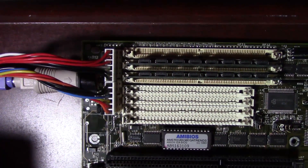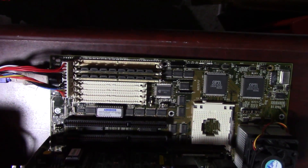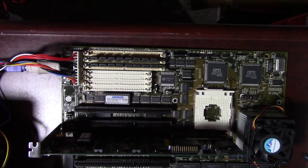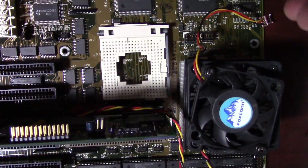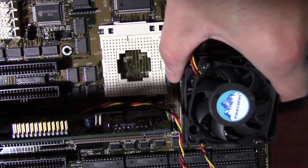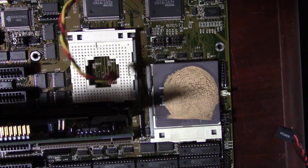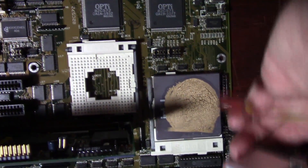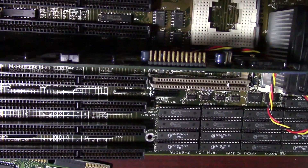Hello there everyone, this is WaybackTech, and in this video I'm going to be taking a look at that mystery board that I fixed in the last video. Gamer1990 used its Columbo-like research skills to figure out exactly what this board actually is. The motherboard in question is a dual socket board featuring socket 3 and 4 on the exact same board. This board was apparently made by Acer, and they call it the V17, though a lot of Opti-based motherboards from this era have a very similar look to them, so I don't really think that Acer actually manufactured this board.